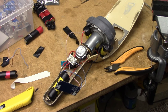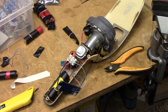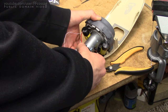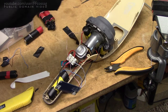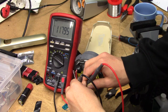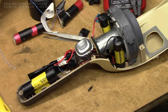That's the protection board and battery pack wired up for a little preliminary test run. We've got about 14 volts out on that connector there, so when I flick the switch this thing should make some noise. Now that's a bit of an improvement, isn't it? Battery voltage on the load — about 3 volts per cell. I've got this loomed up as good as it's going to get.